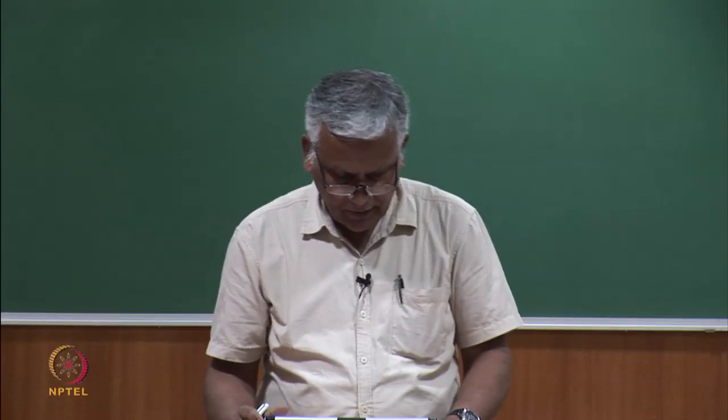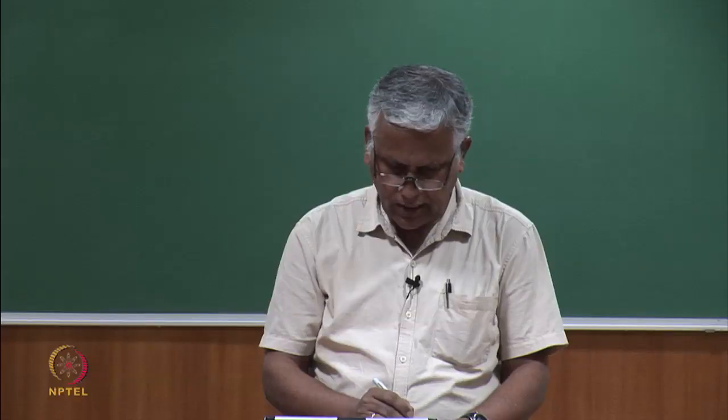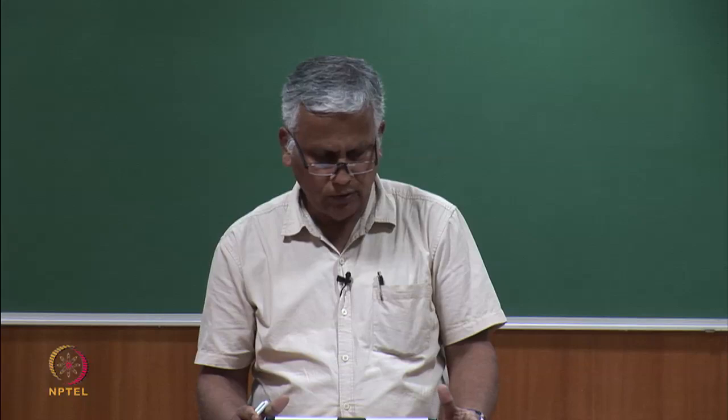The top roller pressure is set at these levels: 16, 13 and 10 decanewton. So, the pressures are actually different in different rollers. So, that is what the 3/3 drafting system is, simple in terms of the number of rollers.